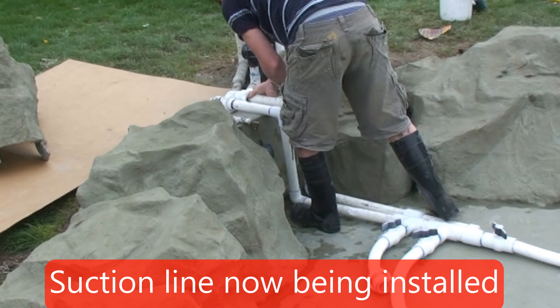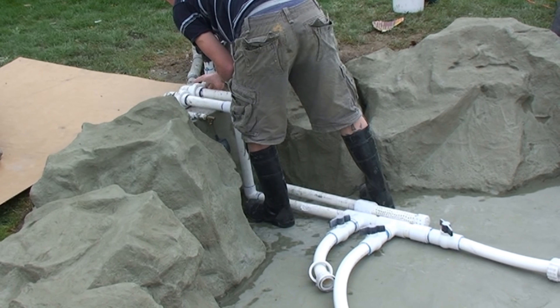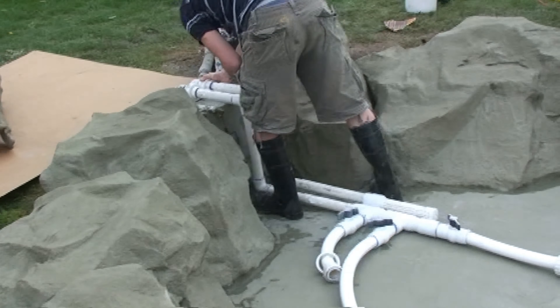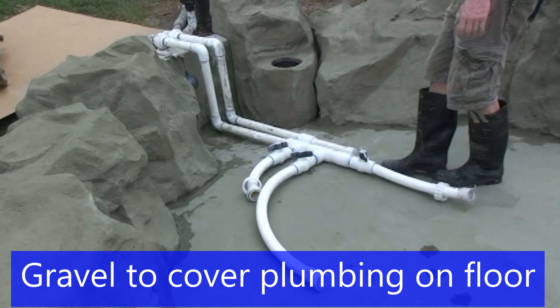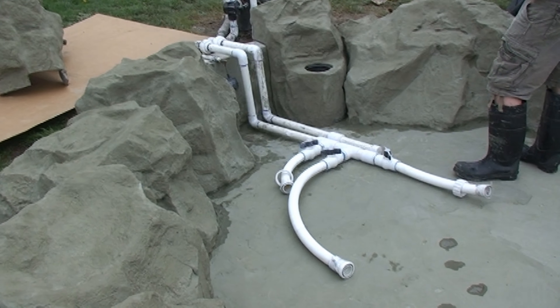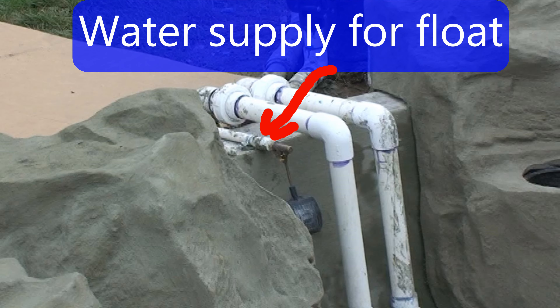All elements of this plumbing system are totally removable and not routed through the concrete shell — in other words, no leaks. You can't bond concrete to PVC; it's going to leak, and we don't want any leaks. That's why we plumb after we've built the feature. And again, we can totally remove and renew any of the elements therein.